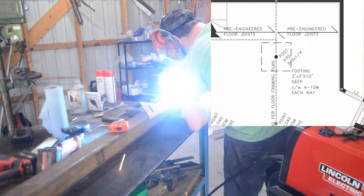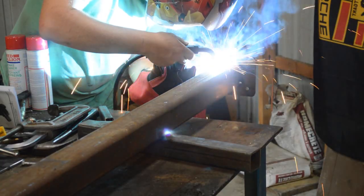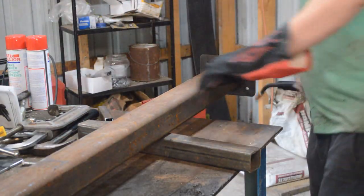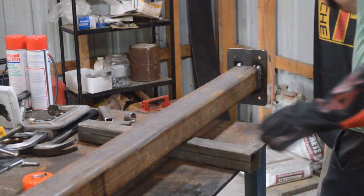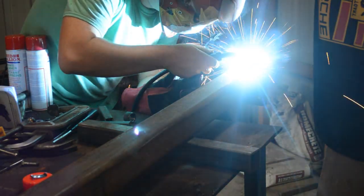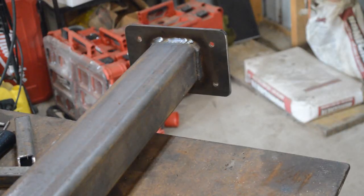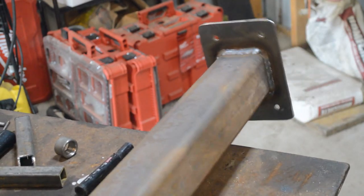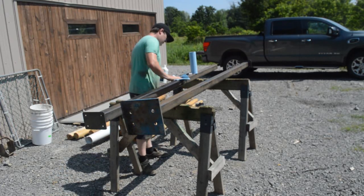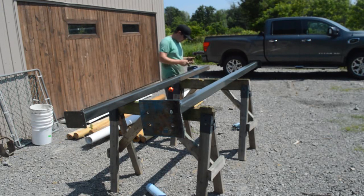With the engineer drawings, there are two posts that hold up the second floor — these go under the two main support beams. They're spec'd out at three inch square tube. I was able to run over to the local metal supply and pick these up. I had them cut a little bit longer so I could double check the measurements on site. Here I am welding the top cap on, then I cut them to length, welded the base plate on, and everything was good to go. These sit on a special footing — a three foot by three foot, approximately 10 inch deep footing that's under the slab. Before I installed them, I gave them a wipe down and a coat of paint to get all the hard to reach areas and so I wasn't getting paint all over the top beam or the floor. This turned out really well.